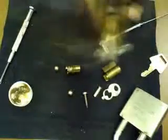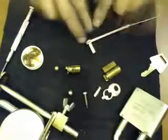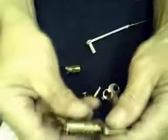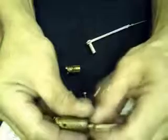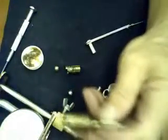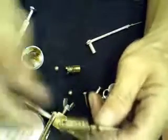After we have disassembled all the parts on this padlock except for the shackle, we can rekey this kind of cylinder. There are cylinders for American padlock which you can rekey without removing the core itself from the core housing, by turning it 180 degrees. And then the pin is just coming out from the bottom hole of this core here, so you can easily re-pin it with the new key on this position.